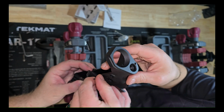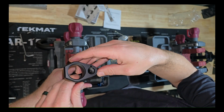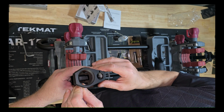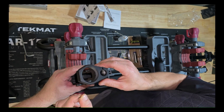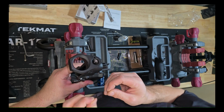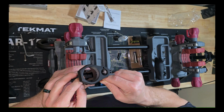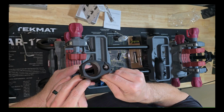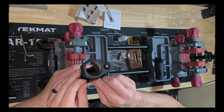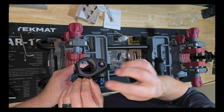And then it's just a simple Allen key here. And then you're just gonna kind of start working it in there. And these are a little bit tricky. It does take some finesse because it is small springs and small spaces you are working with on these. So you got to have some patience, some finesse. You never want to force something in, because then you either widen your hole, or you cross thread or strip, or you even dent your lower or your upper.